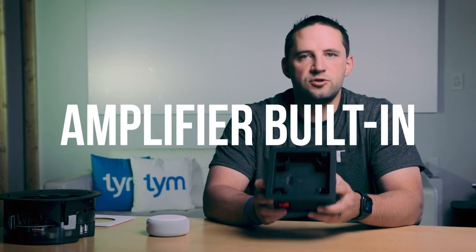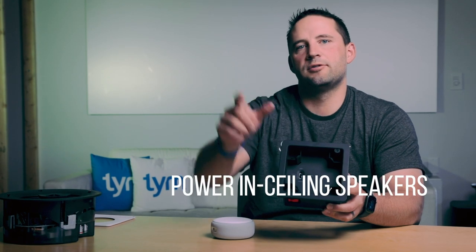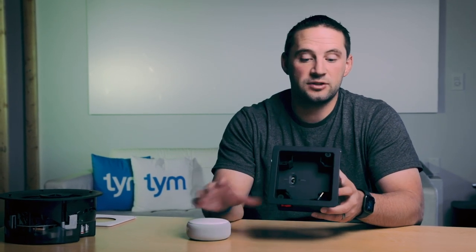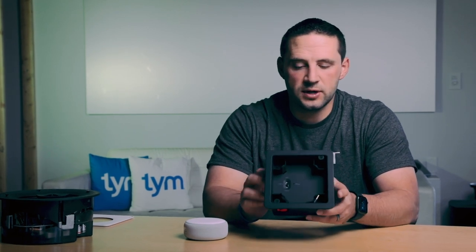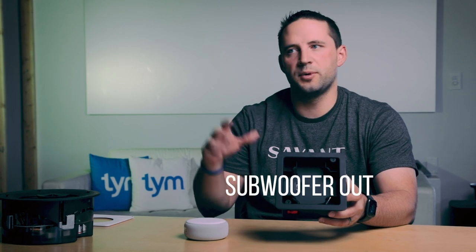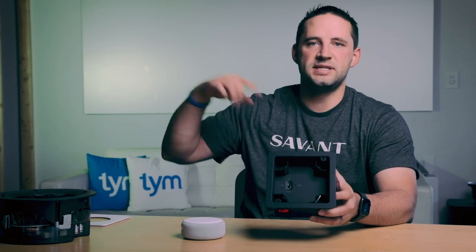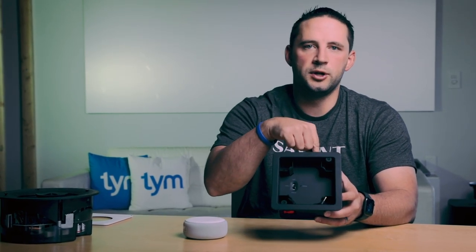This will actually amplify two speakers in the ceiling. Power comes into the unit, it powers your Dot, and it also sends power out to ceiling speakers. It can technically do four speakers, but I'd stick to two given the available power. It also has a subwoofer out — a line out to a powered sub — and you can bring a feed in from the TV, though there are some nuances to that which I'll link below.